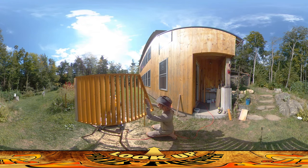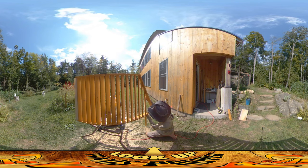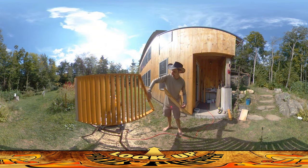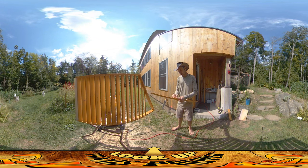I've got that on the back side, and I'm just taking the lip of it and tucking it just around the edge at the top. Then I'm eyeballing and making sure that this is parallel to that. If you close one eye and kind of just sight along, your eye is actually a pretty good judge of what's parallel when you get two lines right next to each other — you can see if they're diverging or approaching. Now, there is a weakness to this technique: every single time I do it, I'm comparing the parallel nature of one board to the prior one, so there's going to be a small error that could compound. But there are only like four of them, so the amount of error I'm going to compile is not that great.